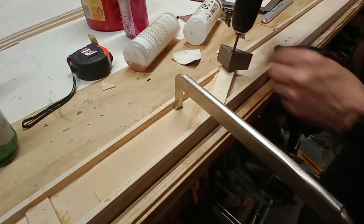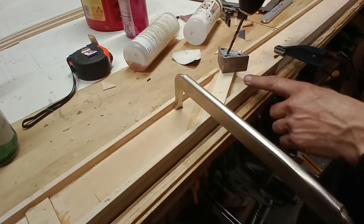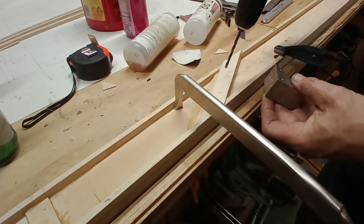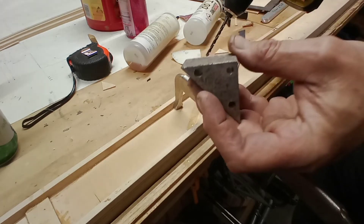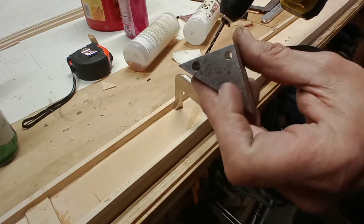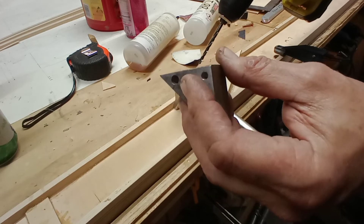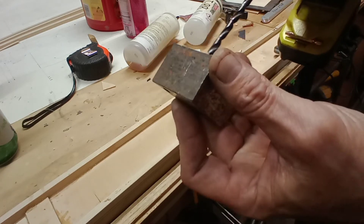I'll go back to using a simple drill jig to get straighter holes. You don't have to use a block of steel — you can use a piece of hardwood. Not something soft like pine, but get a fairly hard piece of wood and get a perpendicular hole drilled through it. That's good enough.